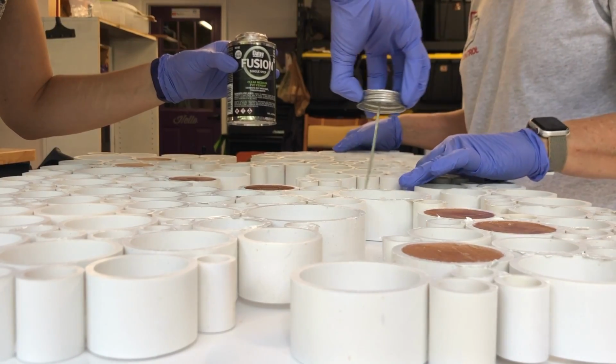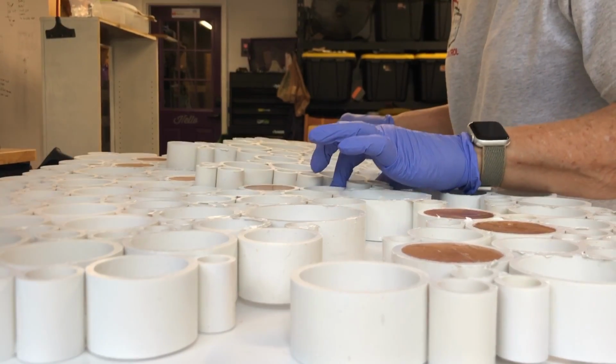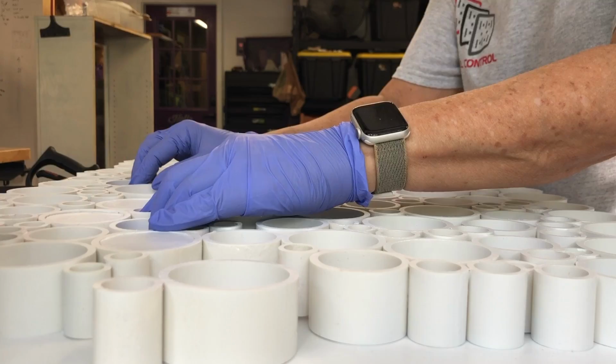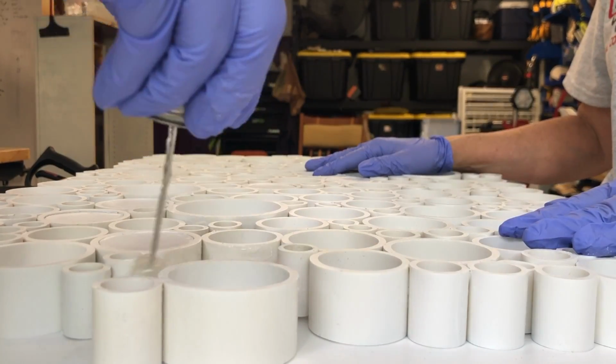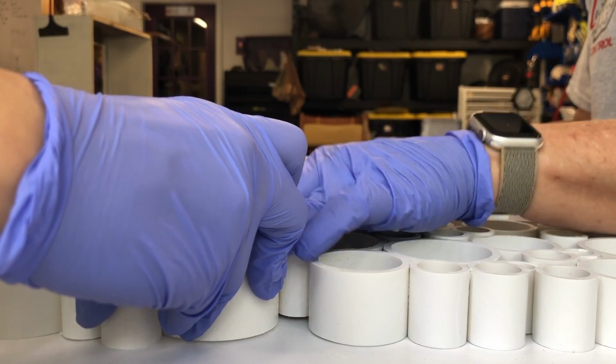And we already told you that we wouldn't use the PVC glue again for this type of application, but something you didn't see in the video is right here. When we had already unmolded one of the panels, it had broken in half. None of the pipe broke, but the glue didn't hold. So we glued it again, and now it's holding strong, but it just still doesn't feel as strong as our original PVC pipe privacy screen. So if we were to do this again, I'd use the construction adhesive because that seemed like it was a stronger hold.